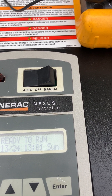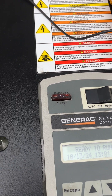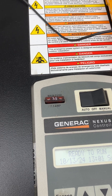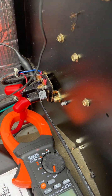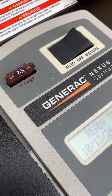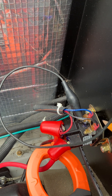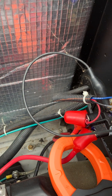In auto, with a good battery — this one is a DieHard Gold, a 35-2 with 640 cold cranking amps; Generac uses the 26R because that physical size fits all the air-cooled models — the controller will say 'start' and take that battery signal, 12 volts, in on this blue wire. This one is already ground, so the coil is energized and it connects the larger cables because the starter draws a lot of current.